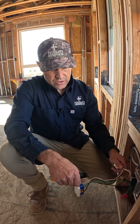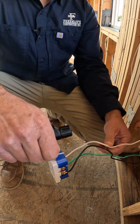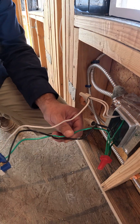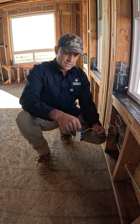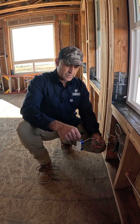Make sure your electrician is pigtailing their outlets when you're building your house. It's a really simple, cheap upgrade for safety. You can also decide to go to 12-gauge wire instead of 14 if you're concerned about a circuit getting too much load on it — though we did that in this house but still protected with 15-amp breakers.